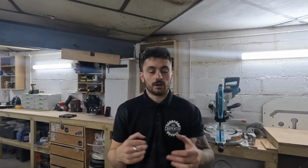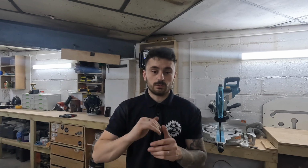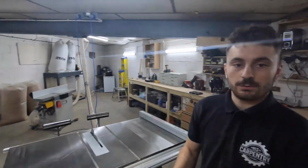So the mouldings around the front and the backside are going to be solid, as well as the drawer boxes, the doors, everything essentially that we can't hide the edge on, because we don't want to use any edge banding on this. Client's not really a great big fan of it, hence why we're using the solid oak where we need to. Everything else will be made up with the oak veneer. So now, let me take you over there.